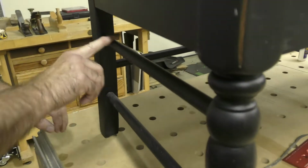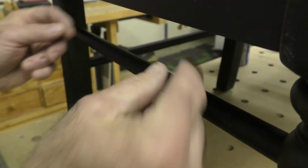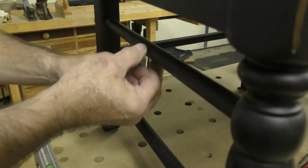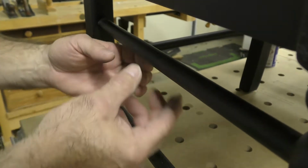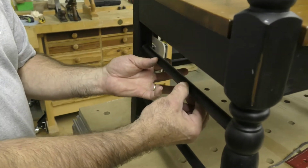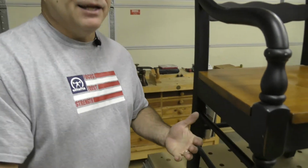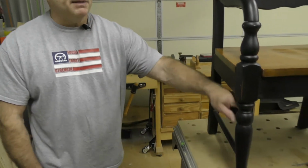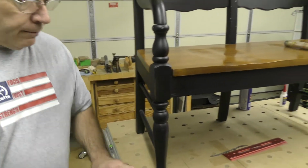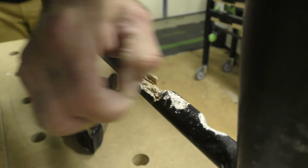You see this rung right here? This top one right here. See this? The dog chewed this completely in half, and it actually was 2 pieces. It was wobbling in the wind. What I did on this one is I went outside and I got a twig, and I took 2 clamps and held a twig in there because I wanted structure in there. And then I put the QuikWood in there, and then I let it dry. Took the clamps off, we were ready to rock and roll. And I just sanded it flush and put a coat of just really inexpensive paint on there. Good? Okay, good. And that's perfect, look. You can actually feel some of that structure coming back in there.